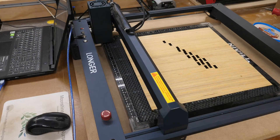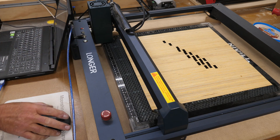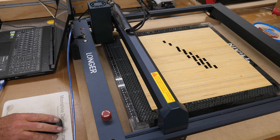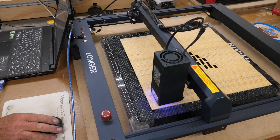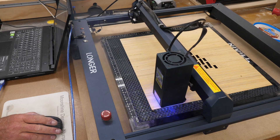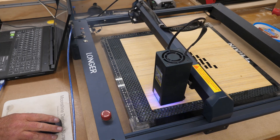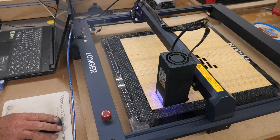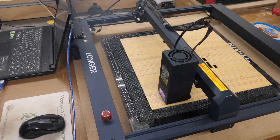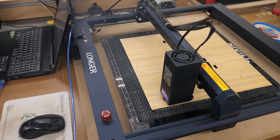Okay, ready to rock and roll. I have not run the laser itself yet — I just framed out where this is going to be. This is a scrap eighth inch plywood. One of the things I do with every laser is run a power scale grid on eighth inch plywood just to see what it'll do. You focus this the same way you do the 30 watt head — it has a little kickstand on the side. You drop it down onto the work. The air assist comes on automatically. Yep, she's running and she's blowing.